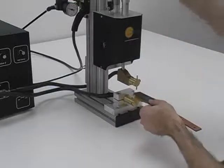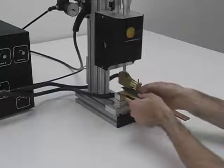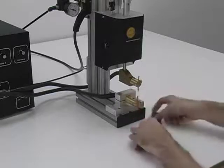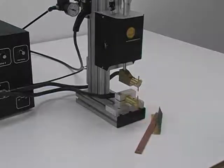Use the stop nut to ensure only light pressure is applied to the electrodes. Pull the sandpaper gently outward while the electrodes are depressed onto a flat hard surface.